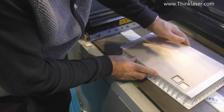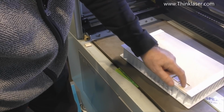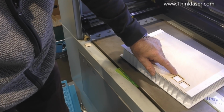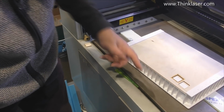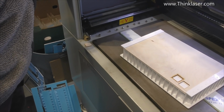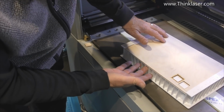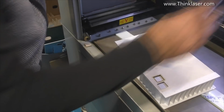And as expected, it's a nice snug fit for our piece of plywood. We've got a solid surface behind here, so we're going to produce exactly the same effect that we did here if we're not careful. We're going to get debris which condenses on this surface and runs out behind the cut. We need to make sure that the fumes that we produce during cutting go right the way through the job, and then we can put air underneath here, remember, where it's a nice clear passageway, and get sucked away.